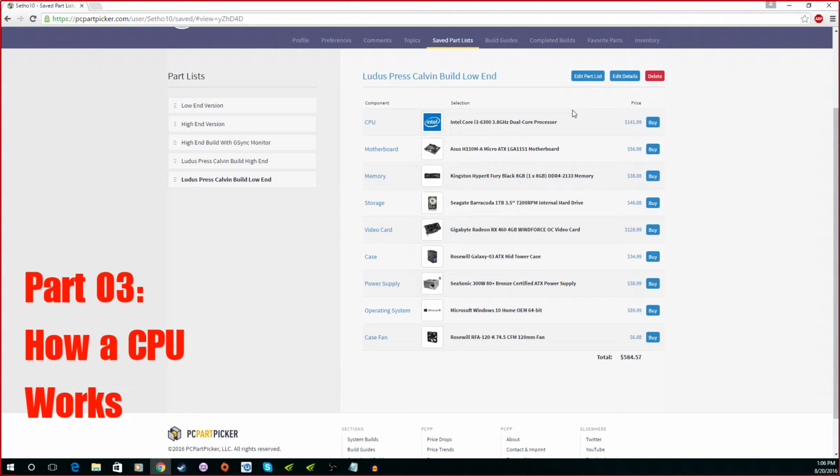And we'll come back to that analogy in a bit because it will help explain a couple things about the nature of dual cores. But that's a very good analogy, and that's exactly what it is. There is a point at which you just simply can't switch the current any faster. The issue is not that you can't switch it at pretty much infinite speeds. It's just a matter of the faster you're doing that, the hotter it gets, and at some point the whole system melts.